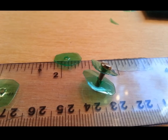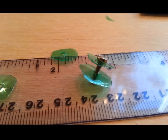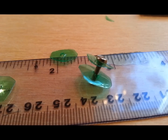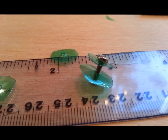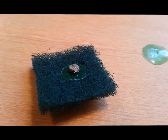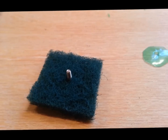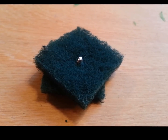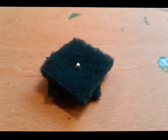What we've made now is a screw assembly. Three to five scouring pad squares will be sandwiched between these two little pieces of plastic and then screwed into the top of the mandrel. The plastic washers act like a clamp, clamping everything tight, and as it spins everything will become round as the edges get worn off. I pushed the first pad through, and now I'm taking the next pad and pushing the screw through its hole. The corners of the pads don't match up, and that's the idea.